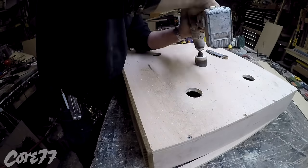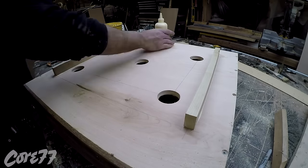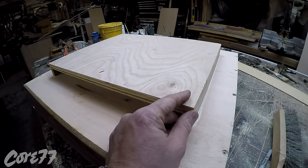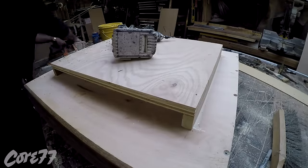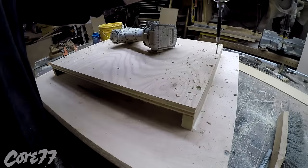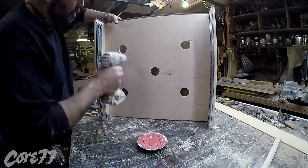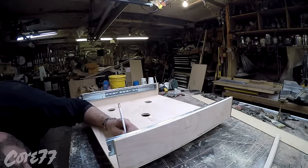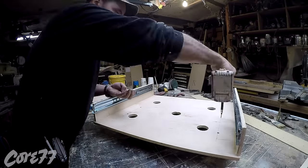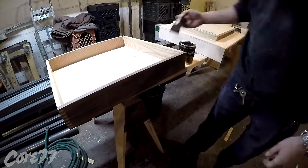Now I'm drilling holes, and this gets a little tricky because I have to go up past the angle iron that's inside there. I need to build another stage that's about an inch and a half high, and because there are some bolts hanging down from in there, I've got to move this stage in a little bit from the edge. It'll become clear when you see me install it. Those big holes I put in are the space by which I'm able to reach up and screw through that three-quarter inch piece. I pre-drill those holes so that when I'm ready, two-inch screws will all be there to just drive home.